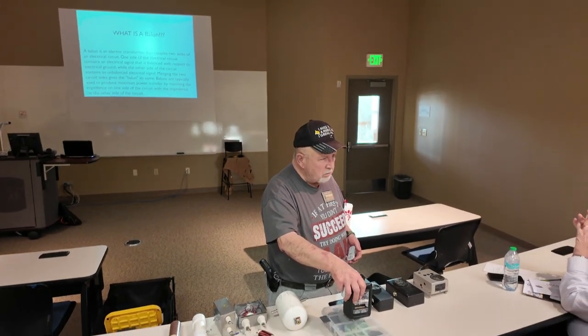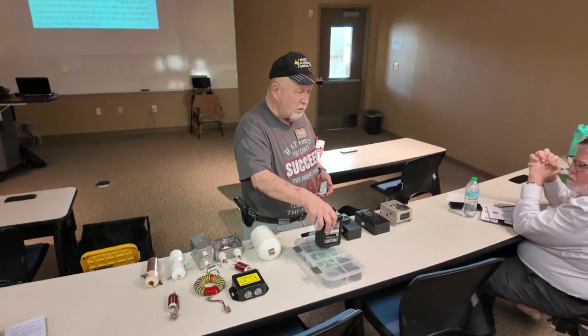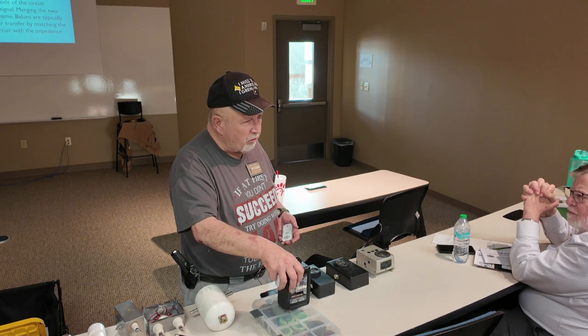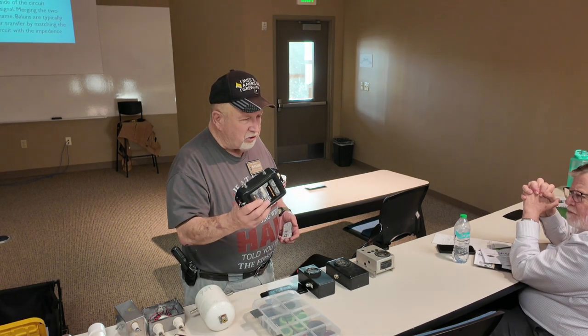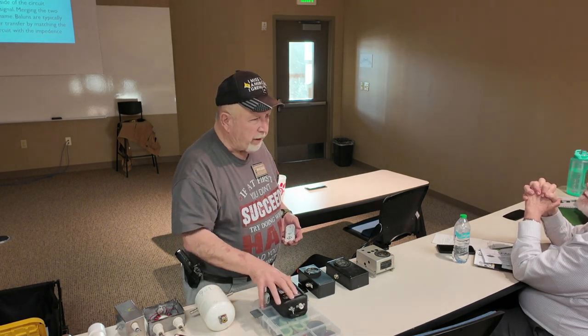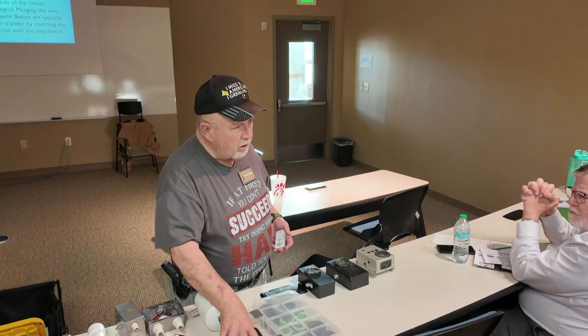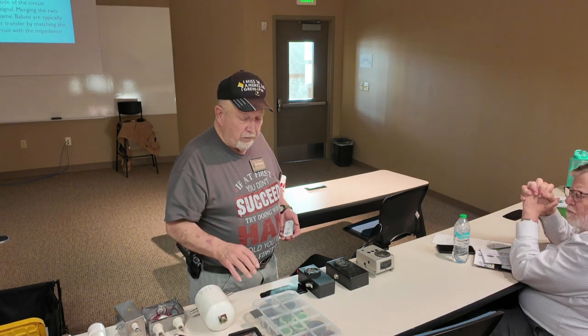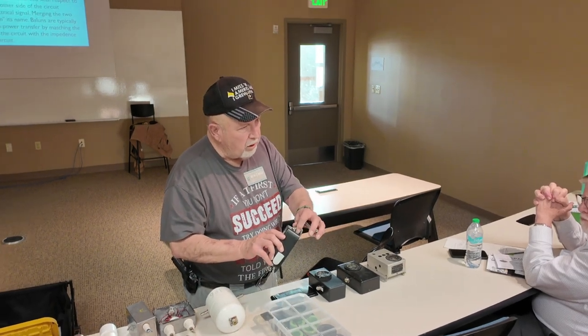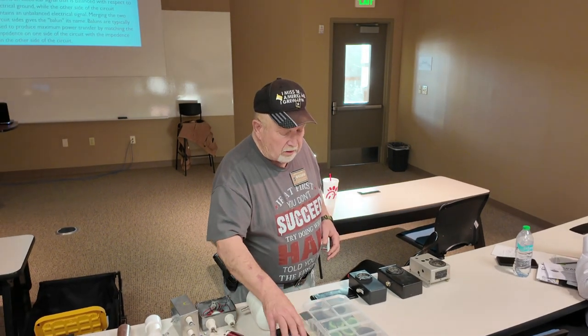These unun wires, this is supposed to be mounted down next to the ground, okay? If you mount it further than, say, 15, 20 feet from the ground and don't have a good ground, this thing is going to put RF back on the coax, and it's going to run all over your shack. And then you're going to have to choke that RF out. So this needs to go right close to where the ground is. That's why you've got a nice ground connector. Otherwise, it's going to go back on the coax.